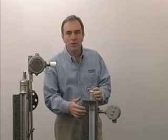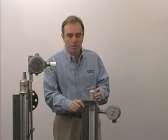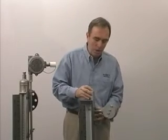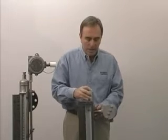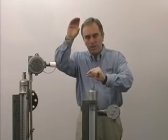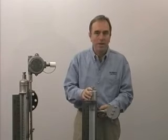So far, all we've talked about is visual indication for the fluid level in the tank. Now let's talk about some control options. On this PVC gauge, I have a level switch mounted. The level switch mounts with just a hose clamp on the side of the chamber. Inside this assembly is a latching reed switch, and when the float goes by, it closes the switch. When the float goes the other way, the switch opens. So you can have a high-level alarm on your magnetic level gauge.